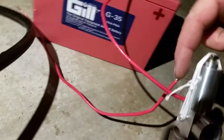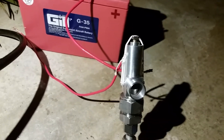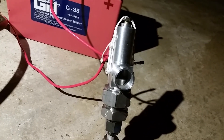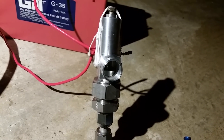On the back side I have a piece of stainless wire around the spectra, hooked up to some big leads going to the battery. In a flight-weight vehicle, that would be nichrome and those wires would be a lot smaller, and we wouldn't have the monster stainless swage lock fitting on the bottom either.